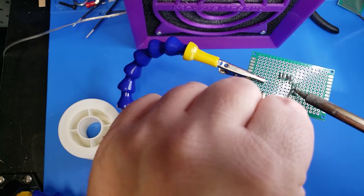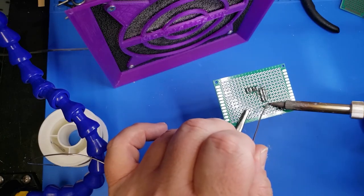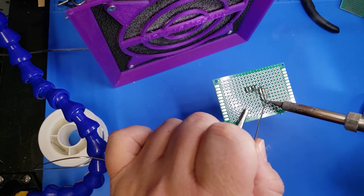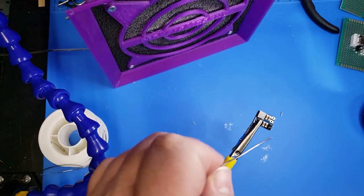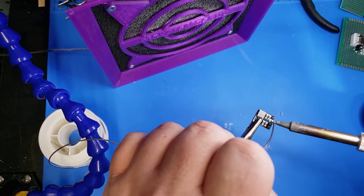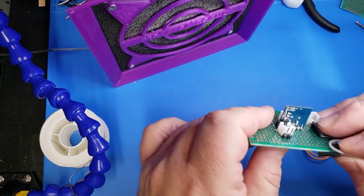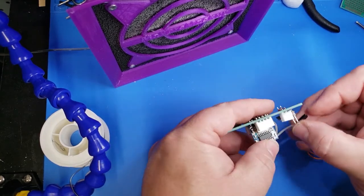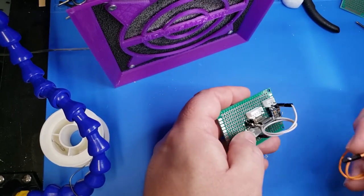The rest of this was just hooking up power, but I had to offer two power options. While the transmitter itself would use the 9 volts — it's a 3 to 40 volt transmitter — the problem is the LEDs were only 5 volts. So I wired in a couple of JST connectors and used a 5 volt buck converter to make sure that the LEDs were only using 5 volts. Essentially all I did was put those on here and wire them so that power runs from the 9 volt battery to both the buck converter for the LEDs and directly to the transmitter itself. I've also included a schematic for this in the description.